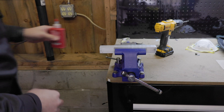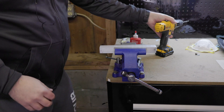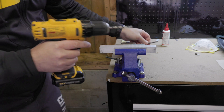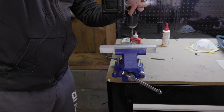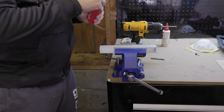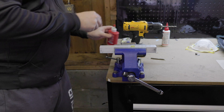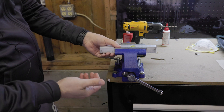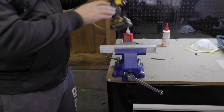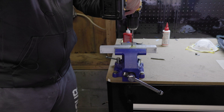To demonstrate how we're going to cut into this, I have a block of aluminum here. We're going to use a quarter-20 tap, but before we do that we're going to drill a hole in the block. It's important to get this hole as square as possible, so if you have a drill press that's what you want to use. And you're not using a quarter-inch drill bit — this is a 13/64ths bit.